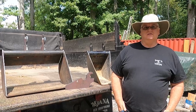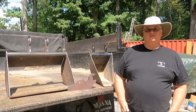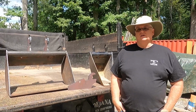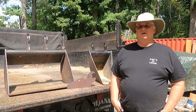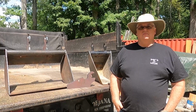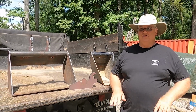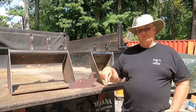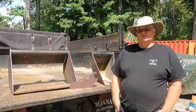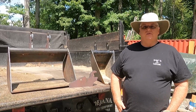We always test to make sure that our system's going to work. We have video on it. We do that to make sure that the ground is going to percolate and has decent drainage. And the other thing is to make sure that we can get to the soil where the ground is going to percolate. A lot of times they use compacted clay on top, and the water just will not go through it. You have to punch through that layer for the dry well to actually work. Usually that's around the 2 foot mark, which is right where our chambers go. Sometimes it's farther and we have to do other things to make that drain.